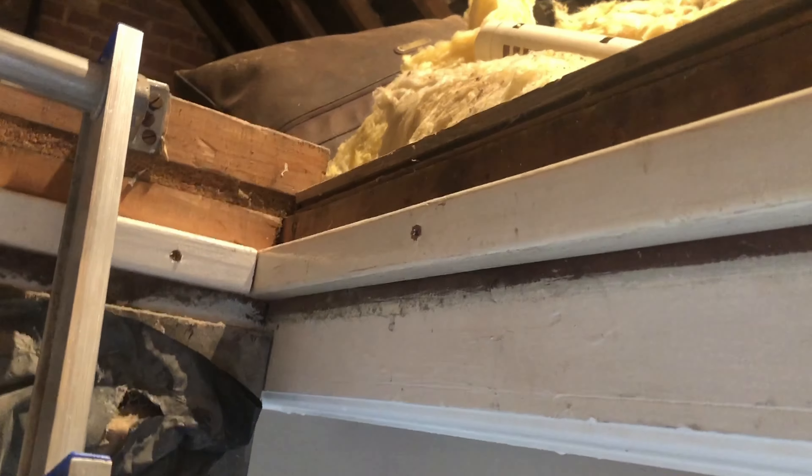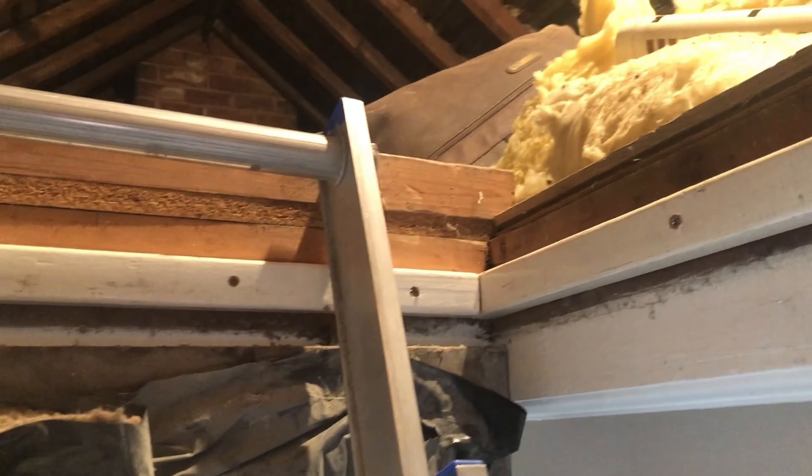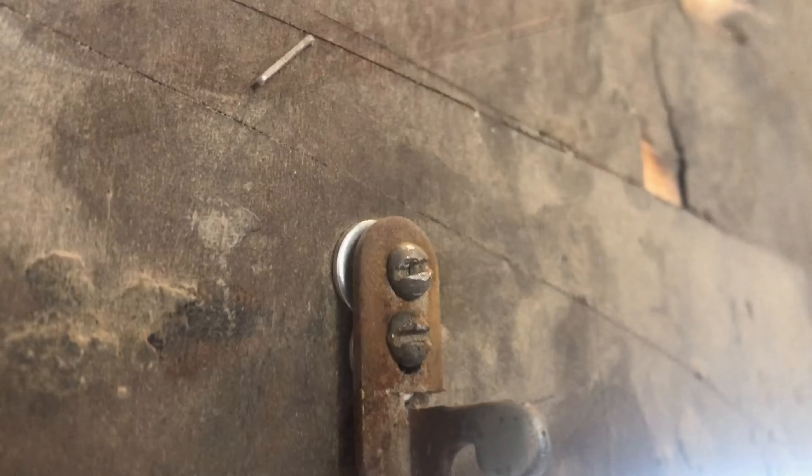So we've cut up a bit of beading for the loft hatch out of some reclaimed timber - that's pre-glossed which will come in handy. I'm up in the loft with the hatch closed from underneath and I'm going to fix this beading in using some sections of draft excluder just for spacing, as it's critical to spacing. Too much compression will mean the hatch won't shut and too little will render it fairly ineffective in terms of air sealing.